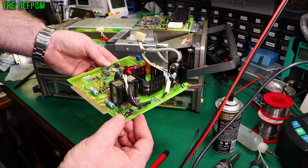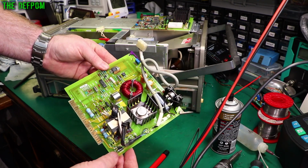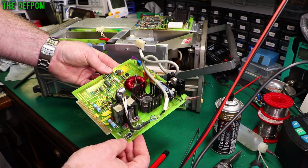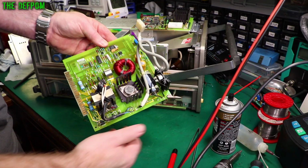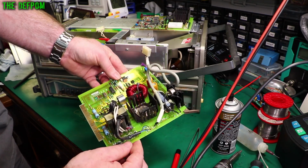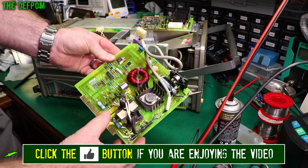I think this board will require a closer look than the first one. It seems to have a capacitor on there, some bits and pieces. And this is a board which got referenced a lot on the EEVblog forum about having bad parts. Remember C10 was it, or CR200 or something like that? I think I mentioned it as being a problematic diode. Anyway, it's a number they mentioned. We'll have a look around it. I might just test all the diodes on this board because these are known for being problematic.